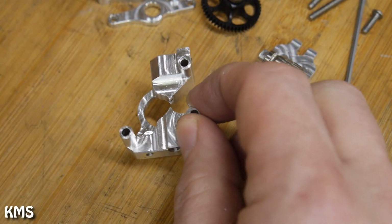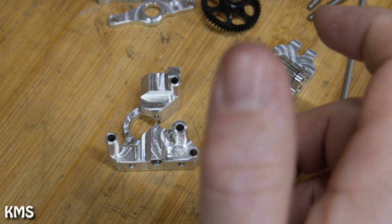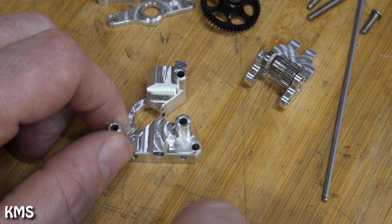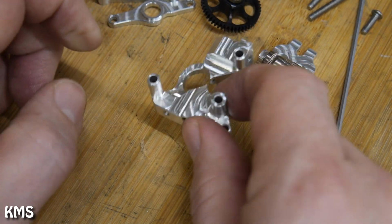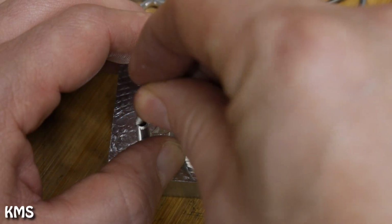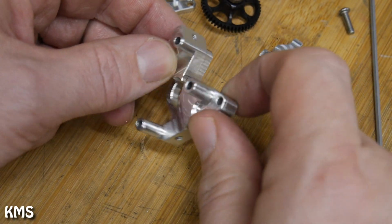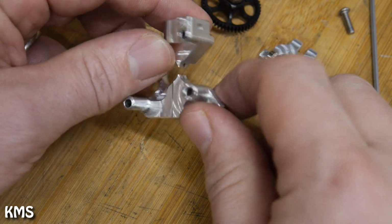Again, I decided to do this on the 4th axis, simply because this reduces the amount of operations significantly, because I can change my orientation anytime I want to. In the end, I was left with a part that had a cutoff over here in this area, and I made myself a mounting plate, this one, put this part on here, screwed it down with some screws, and then went around with an end mill to clean up this cutoff area in a second operation. In a third operation, I drilled this hole and tapped it, and then this part was done as well.